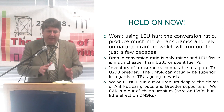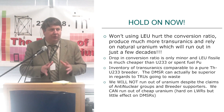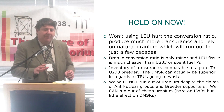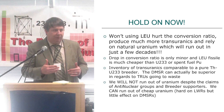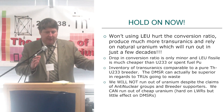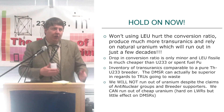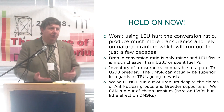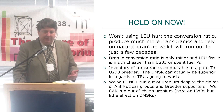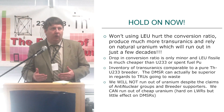And talking about transuranic waste: the inventory of transuranics in the salt is actually comparable to the pure thorium-U-233 breeder — and I'll have to repeat that, because most of you won't believe me. It does get produced at a higher rate, but these designs typically had a softer spectrum, so the cross-section is larger. When you look at equilibrium levels, if you're recycling it, you get a few hundred kilograms in a pure cycle per gigawatt, and maybe a ton in the DMSR. It can actually be superior in the amount of transuranics that go to waste.